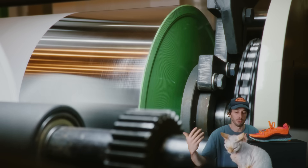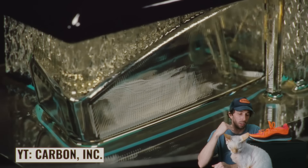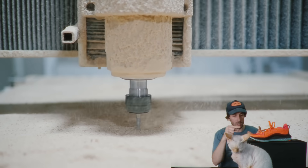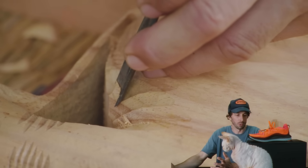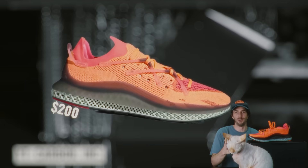Most importantly to Adidas, it's a significantly more efficient way of making this really complex three-dimensional structure. Being involved in manufacturing and woodworking my whole life, I think people sleep on this more than anything with this shoe: you could only do it with this style of 3D printing. If you tried it with molds, there's no way you get the molds to release and get those internal structures. There's no way a CNC bit could get into every single nook and cranny, especially on the internal bits. The only other way would be hand-carving it, which would take months of skilled labor and makes zero sense. So to me it really is a modern material science miracle that you can buy this shoe for $200.